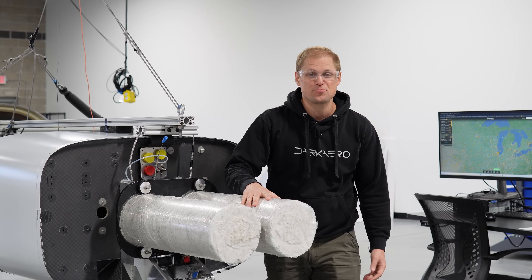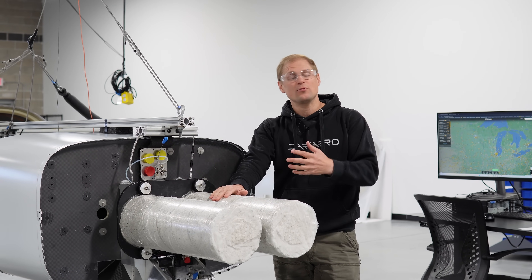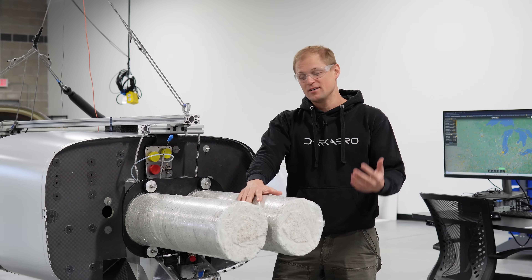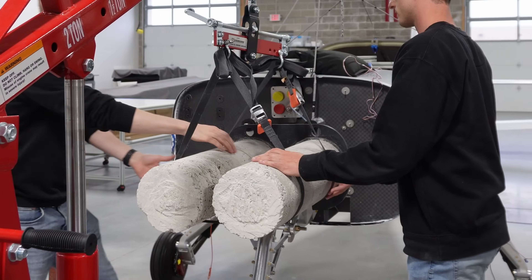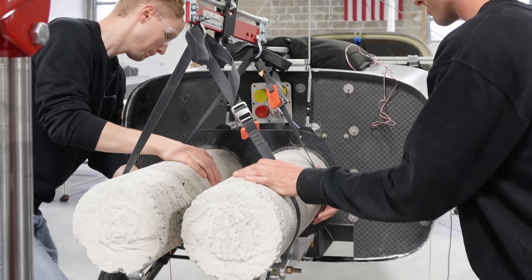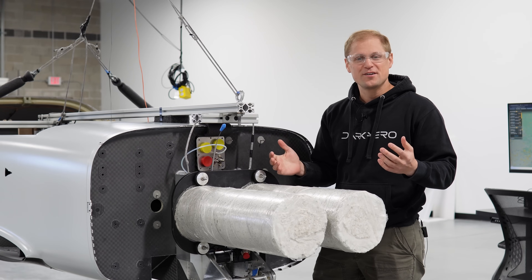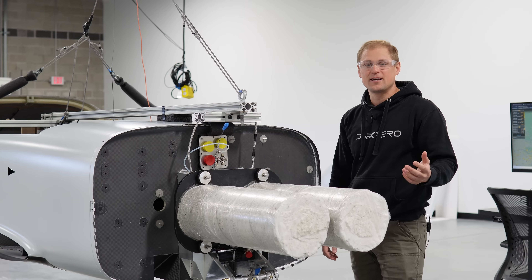The first test-specific piece of hardware that's probably most prominent on the front of the aircraft is our engine mass simulator. We didn't want to drop the airplane with the engine attached in case something went wrong — we don't want to break the engine, it's a pretty expensive piece of hardware. So we replaced the mass of the engine with this: two cylinders cast out of Quikrete with threaded rod in them. The threaded rod bolts into a water-jet cut steel plate that has the same bolt pattern as the engine to interface with the engine mount. We weren't certain how it was going to behave during drop testing — concrete is pretty brittle and could have just fallen apart — but it held together pretty nicely throughout the whole drop test campaign.